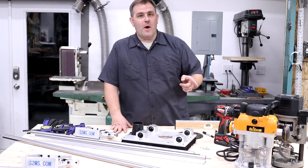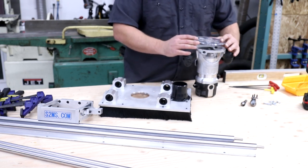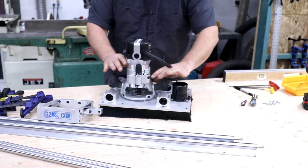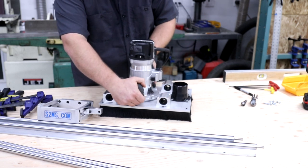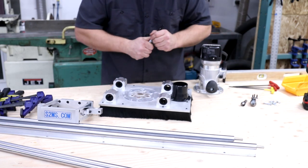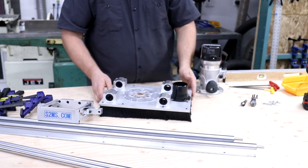If you don't have a Porter Cable 3.25 horsepower router or a Triton high horsepower router, we'll show you how to drill the holes to get that set up. To mount a router besides the Porter Cable or Triton, the best way is to take the bolts off and loosen the bottom plate. You can put a mark on there so you can follow it, then flip it upside down. You don't want your handles going this way because we're going to have rails going through and a dust collection port here, so some handles stick over that. Keeping the base plate with the router in an orientation like this is good — lift it off. Now I can center the plate and make sure my holes are not going over the other ones. Take your marker, mark your holes or use a center punch, and drill your holes. Then on the bottom side, we like to countersink them to keep the fasteners out of the way of your table or whatever you're working on.